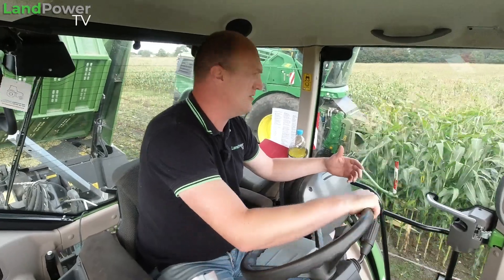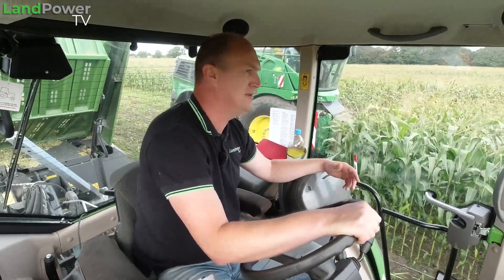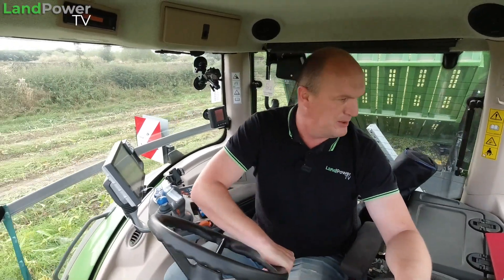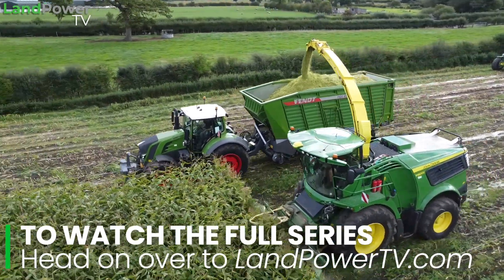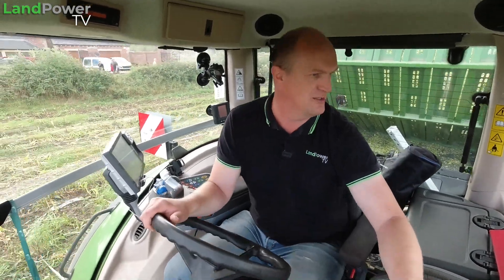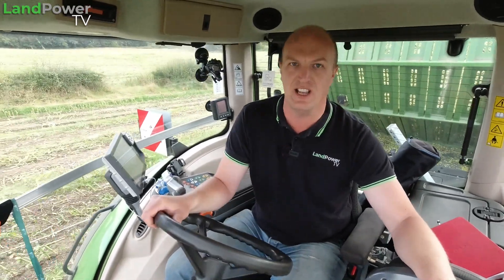In terms of my priorities for today — we're in a pretty much ring-fenced farm with quite a few farm tracks to navigate, maybe 20-minute round trips, so not huge distances. I won't put protecting the soil as number one in this instance because we're hauling maize and this ground will be ploughed up within a few days, which will take away most of the shallow to medium depth compaction. That said, I do want to protect the soils a little — I don't want rock hard tyres forcing all the weight of the tractor and wagons deep into the ground. So I've got one eye on soil compaction.